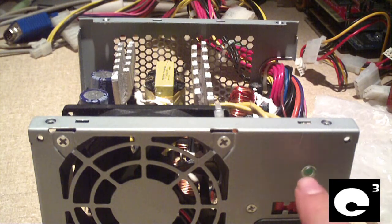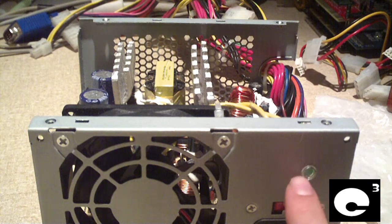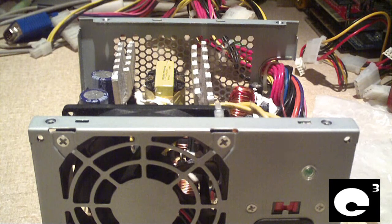People ask me about these power supplies concerning this little light here. Their computer will stop working and when they plug it in, you'll see this light flash. YouTube user Buzz in the OK sent me a message about the capacitors and which one causes a failure. He also mentions that sticking a hair dryer into the power supply on high for about a minute will actually get it to start working.